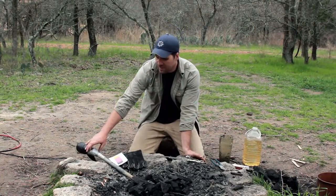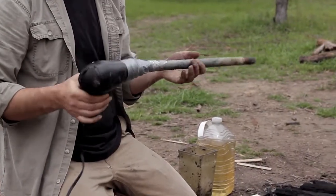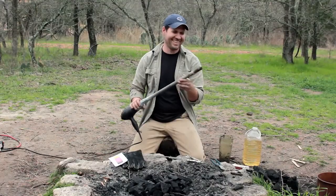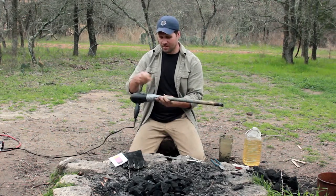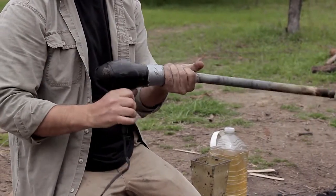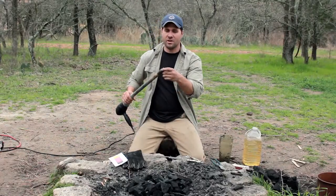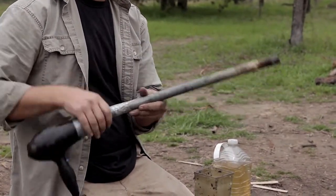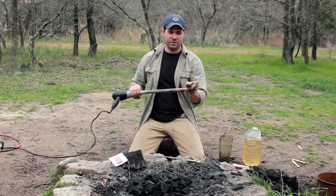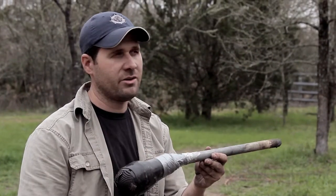You can see we've got this hairdryer here — this is a pretty fancy system for stoking up. It's really expensive, but we've got a little piece of fencing pipe with duct tape, and this just separates the hairdryer from the heat. You can see this pipe is kind of melted on the end because it's in the really hottest part of the fire. This hairdryer is just going to stoke the coals — it's a really cheap way to stoke your fire. There are other expensive ways, but we're talking backyard knife-making here. Probably don't use your wife's hairdryer — go to the thrift store and get one.